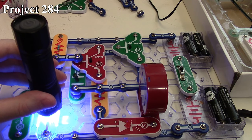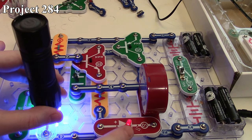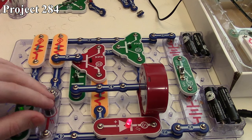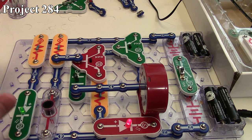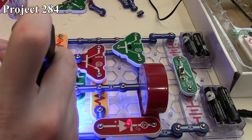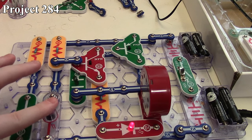Like the mail notifying system, if there is light coming through on the photoresistor, no sound comes out of the speaker — though interestingly our LED stays lit up. When we start to break the light, we get this electronic noise from our speaker which varies with the photoresistor. The general idea is that it works when either fully closed or with light on it. It's our resonant frequency being generated through our capacitor making our electronic bell.